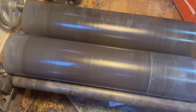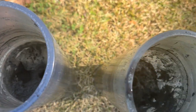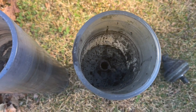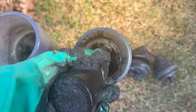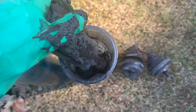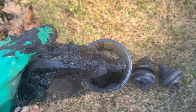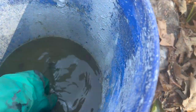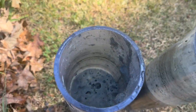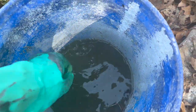The first thing I'm going to do is turn this off, pull these out, drop them back in the acid bath, and let you all take a look at them. Both tubes are off the tumblers. You can see that nasty black-looking stuff — that's the silicon carbide mixed with water, as well as some of the nastiness off of the glass. Right now it doesn't look very impressive. I'm going to dump them out, get all my copper pieces off with the garden hose, then dunk them back in the bucket of acid to get the majority of this black stuff off. You can already tell they're going to look pretty awesome. Then I'll show you all the finished product.